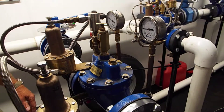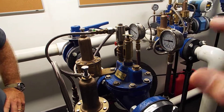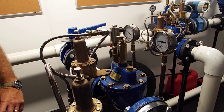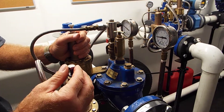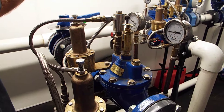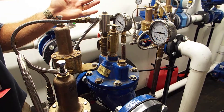So Kevin, the question I have — if I'm going to take a tank out of service to get painted or rehabilitated, this is the valve, this is the application where that tank would be. I would basically install this valve, correct? Correct. This is the pressure-reducing valve. You're trying to protect the people downstream. You want to knock their pressure down — you're coming off a high pressure zone and you have some older infrastructure.